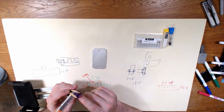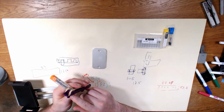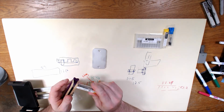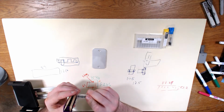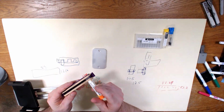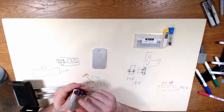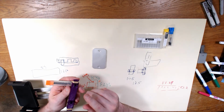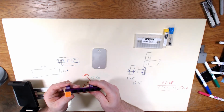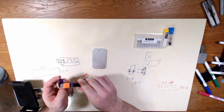The last thing we're going to change here is the little retaining tabs that I put in here. I just had them at 0.5 millimeter, and I use a 0.6mm nozzle on my Prusa, which means that basically they don't exist. The slicer tries to put them in there, and it's like, hey, here's a little bump for you, but unfortunately, it's really not anything that you can tell. So I'm going to go ahead and make those a little bit bigger so that they actually get printed and actually do their job. So yeah, that is the rundown on this first piece we did.